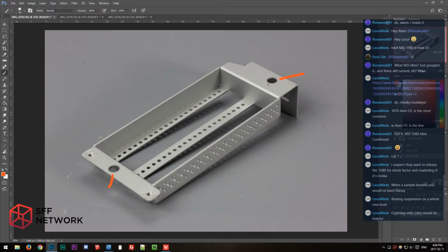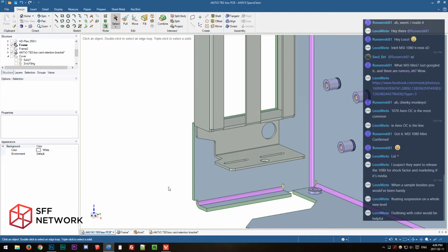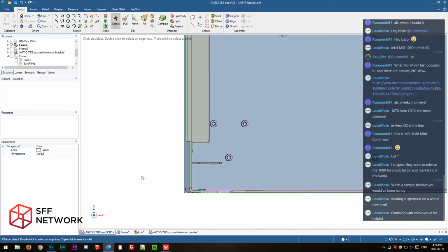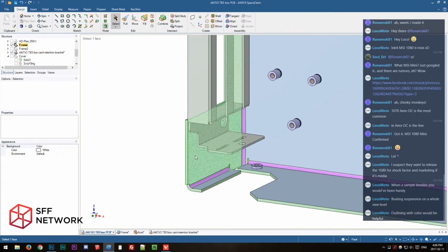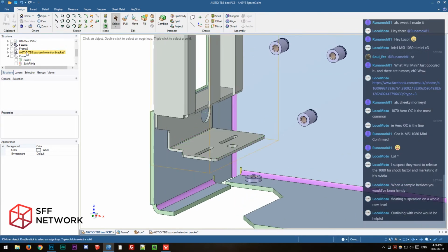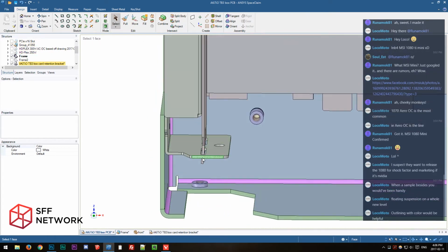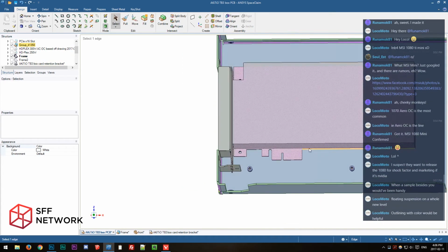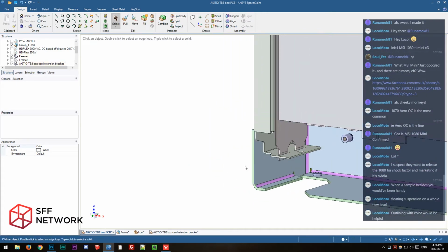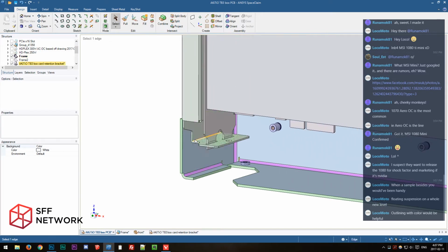Yeah, because I think it's small enough in reality that you could put just a small washer on it to kind of hold it, and that would keep the bottom edge of the bracket from moving back and forward towards the front of the case, away from the frame. I mean, it wouldn't be a huge deal if it's not really secured, because once you have the video card installed, the tabs of the video card will catch these slots, and that will hold it in place. And then the video card itself will be held in place by the PCI Express slot on the circuit board, which of course is held in with several standoffs. So not a big deal if we don't do anything about the bottom of this. I was just thinking, if it wasn't a big deal, it'd be nice to secure it just for completeness. But yeah, it wouldn't be the end of the world if we didn't.